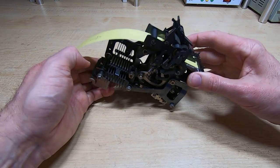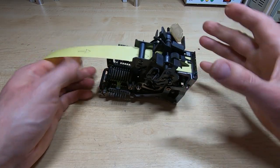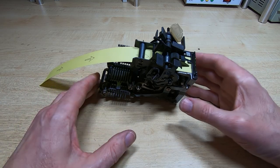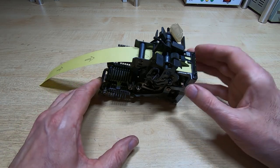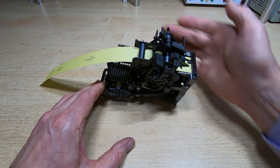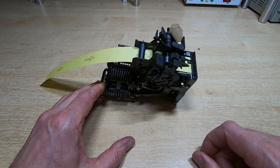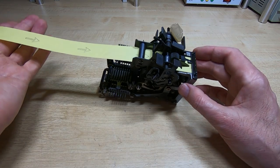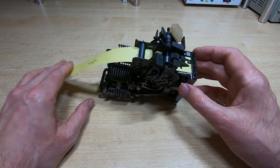As you can see, it appears to be working fine — all nice and clean. The punches are fairly easy to work on and because they come out of the machine so easily, if you do have a problem it's normally fairly easy to sort out by working the lever back and forth to see what's not doing what it's supposed to. I'll get this fitted back into the machine and in the next video we'll look at the tape reader.